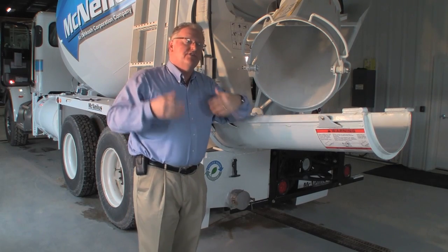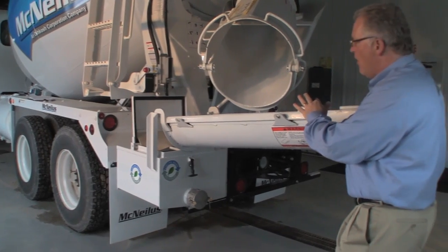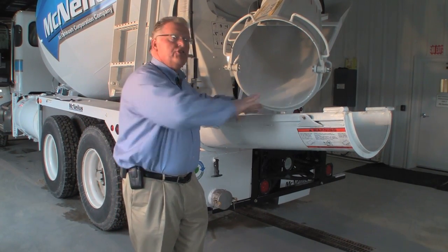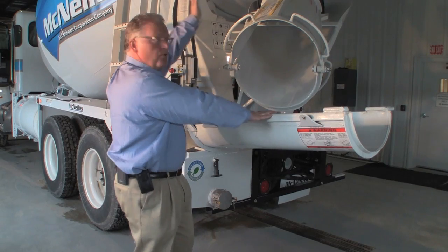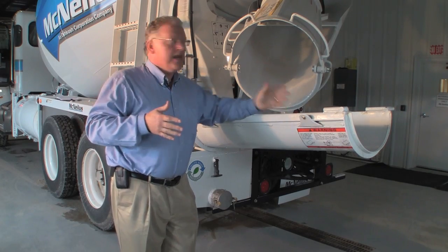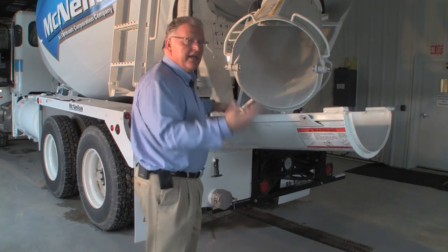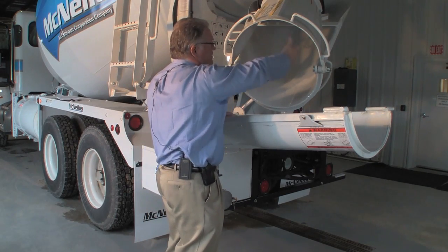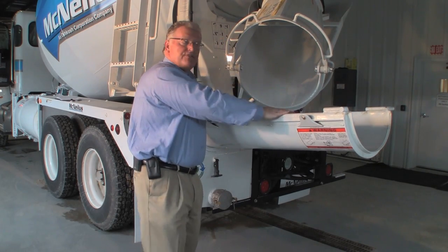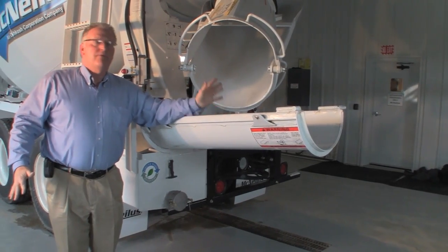On a five-chute wash, take your hose and rinse chute five all the way down, take it off, hang it, and put it away. Take chute four, do the same, and then once you have chute three on the truck, start the washdown procedure from the top down. The driver will climb the ladder, wash down around the boot and the hopper, and work all the debris down the main chute. Once done working top down, take the hose and rinse off the flop-down from underneath and finish rinsing the main chute. Then simply rinse down the third chute, take the chute off, hang it, and put it away.